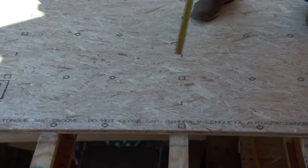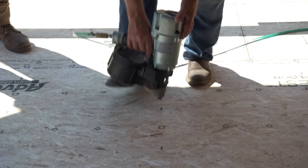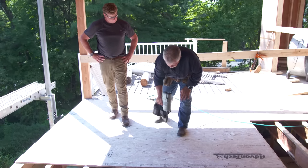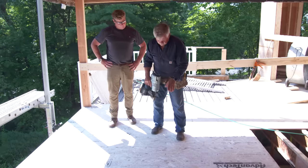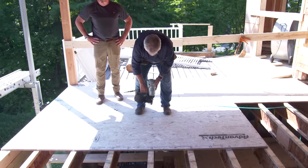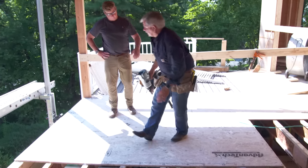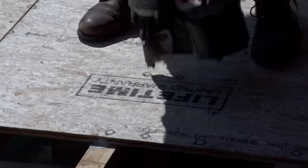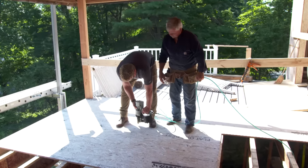You're ready to nail it. See how these marks line up with the joists all the way down — start on this side and nail into those marks all the way along. A lot of people don't know that the nail gun won't pull the material down; it will just hold it there. Make sure the material is tight to the joist — stand on each side of the joist right here, pushing down, then nail it. If you reach out, it won't go tight.